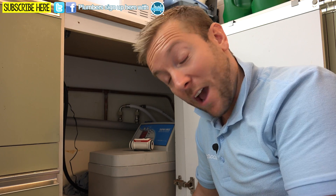Before we continue, it's a good idea to consult the instructions and check whether you're feeding the whole house or just a combi boiler. If you're feeding the whole house, you'll need to swap where your shut-off valve is so it's on the outlet of the Salamander pump. Because I'm feeding the whole house on this job today, that's exactly what I'm going to do. Installing the Salamander pump on the pipe work usually takes about five minutes — normally you've just got a straight bit of pipe, cut a section out, pop your Salamander pump in, tighten it all up, plug the power in, and get it going. Because we need to make some pipe alterations here, watch this next bit in quick-time.